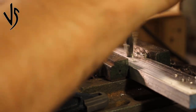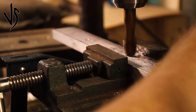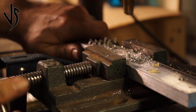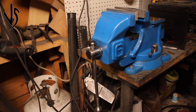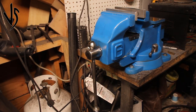The actual teeth of the vise were pretty messed up, so what you're seeing here is me making new soft jaws out of aluminum for the vise. I do have another leg vise in the shop if I have to heat things up a lot. Instead of giving me a true countersink, I just made a much larger hole instead — primarily because I didn't have a countersink available in the shop.